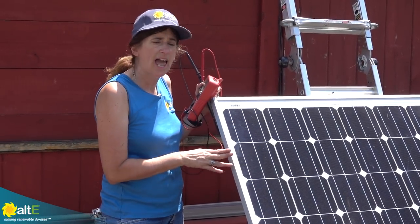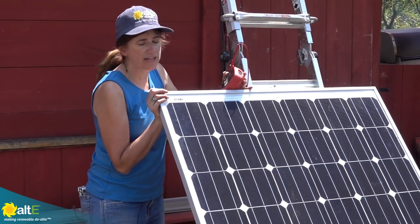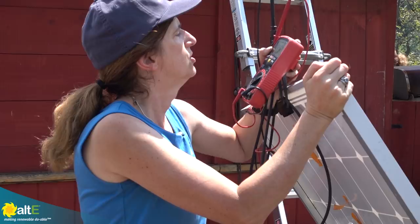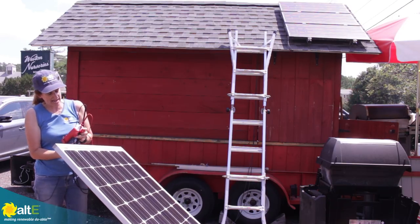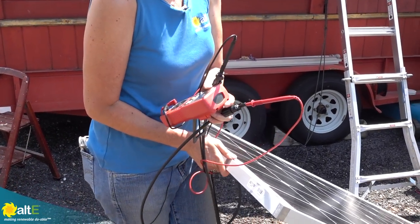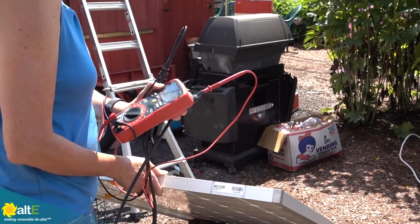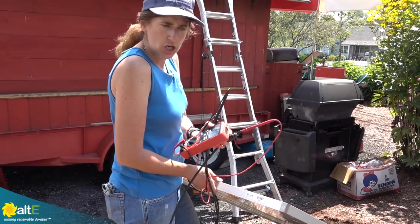I'm not at a perfect tilt and I'm not facing the sun. So just for fun, let's rotate this towards the sun and see what improvements we get. I've got 6.6, 7 amps, 7.8, 8.5, 8.6 — and now I'm up at 9 amps. So you see by changing the angle and changing the direction, it makes a huge difference.